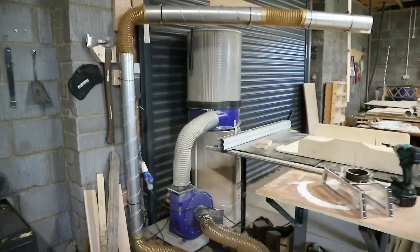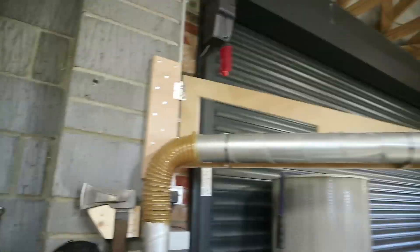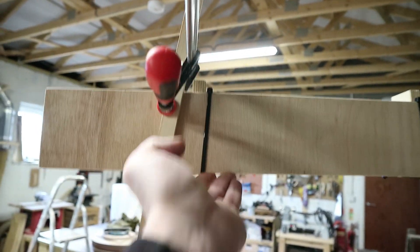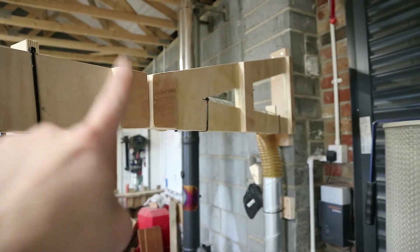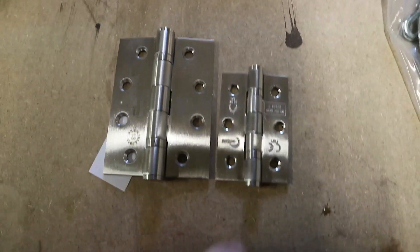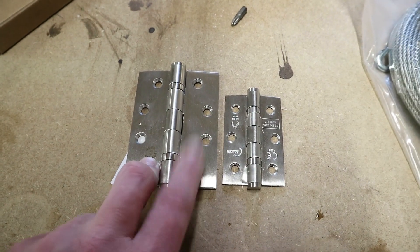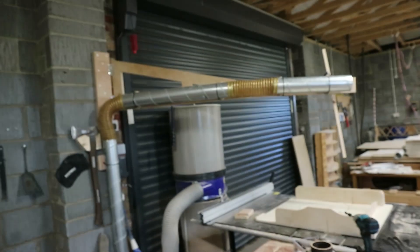So this is where we're at — it's looking sort of good. Just bear in mind we're not finished. We have a temporary pipe coming out of here going into some four-inch rigid ducting, going up here — nice and tidy, liking it. Got a couple of problems though. We have a lot of flex in this joint here, and we've got some twist in this beam along here. So we've got to take the twist out, sort the flex out of both joints. These are the old hinges and these are the new hinges — quite a bit of difference. These are C7s — grade 7s — rated up to 40 kilos. And these are C13s — grade 13s — rated up to 120 kilos. So hopefully that's going to deal with a lot of the problem. And we've gone and got a catenary wire kit just to stop this from dropping even more.